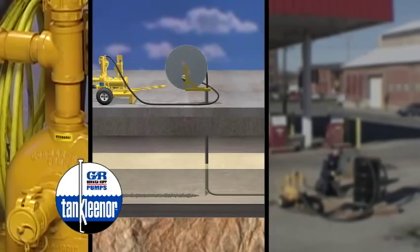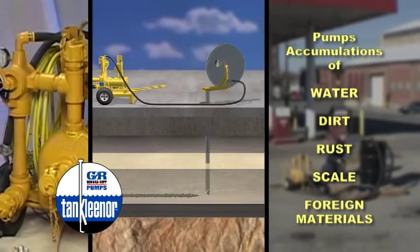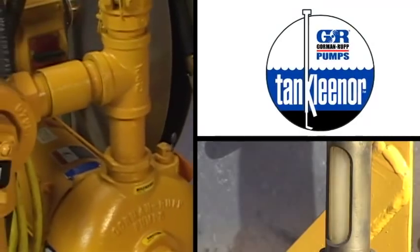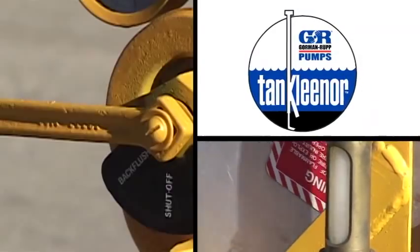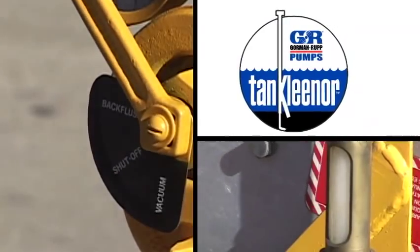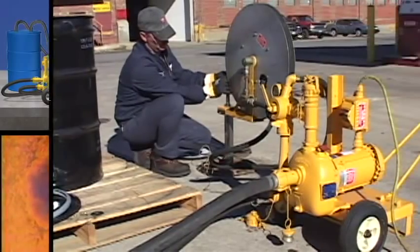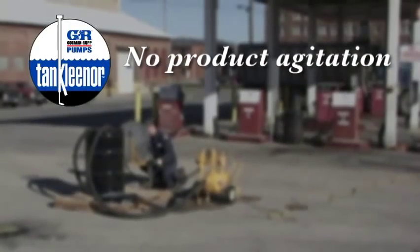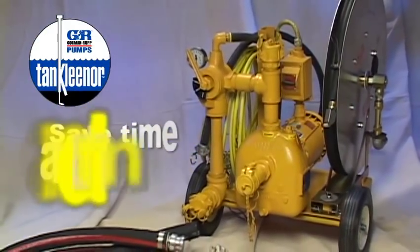The tank cleaner is used to pump accumulations of water, dirt, rust, scale, and other foreign materials from the tank while removing only a minimal amount of the petroleum product. The specially designed Gorman-Rupp tank cleaner accomplishes this by using the Venturi principle created in the eductor valve of the unit. An efficient and inexpensive alternative to the degassing and manual scouring method of tank cleaning, the tank cleaner also allows the tank to be cleaned at regular intervals without removing it from service. There's no product agitation or risk of placing the contaminants back into suspension — meaning you save both time and money.